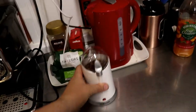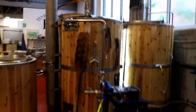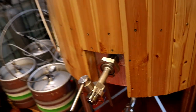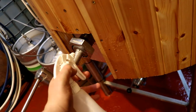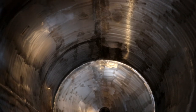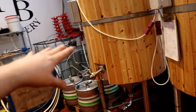We've got my coffee ready to go tomorrow morning - bit of Taylor's of Harrogate Rich Italian Roast number 4, so we'll be having espresso first thing. We're just filling up the HLT. Gemma and I have just taken all the valves off the empty tanks. What I like to do is get behind all of the O-rings, clean everything manually, and then upon reassembly hit everything with a blast of para-acetic acid as we assemble it to make sure it's all perfectly clean. The lid will go back on tomorrow, and then we'll hit the whole thing with a dose of caustic, then take the caustic out and put it into the next tank, rinse this one out, and give it a dose of acid as well.